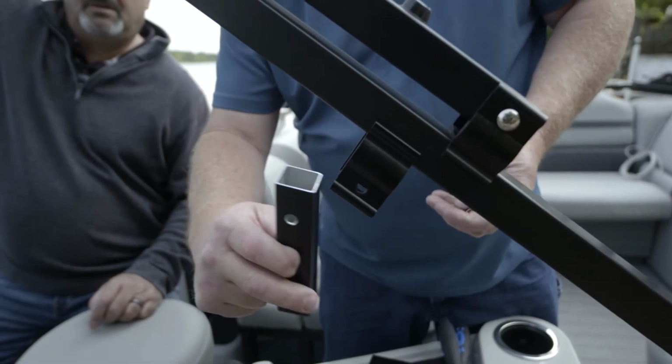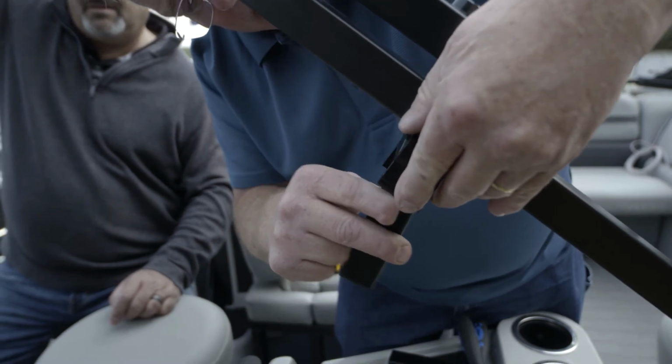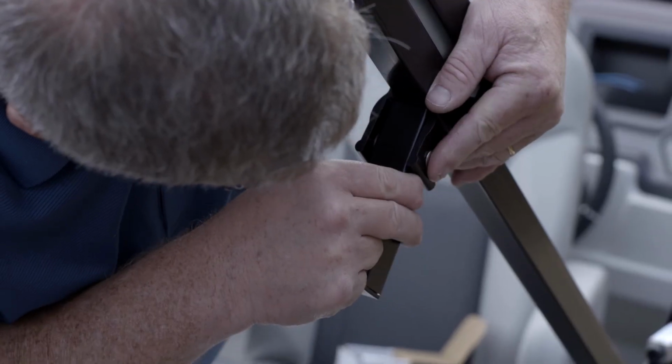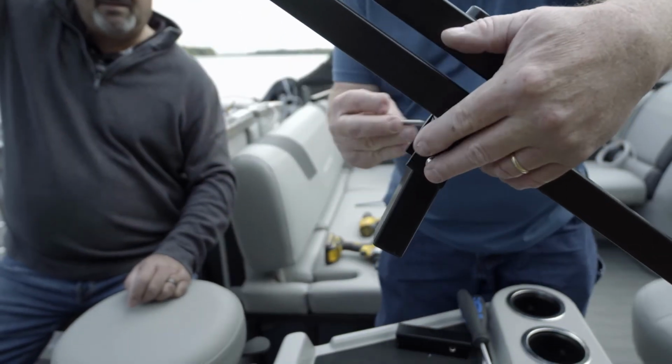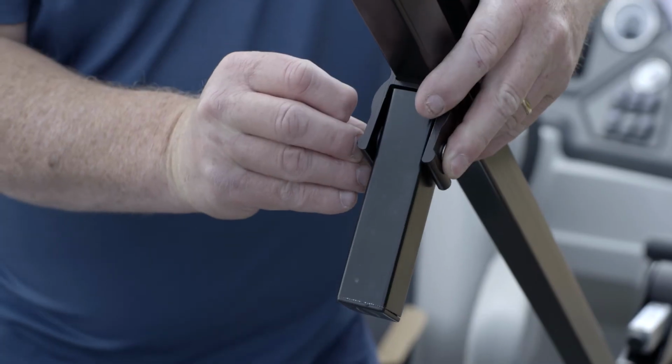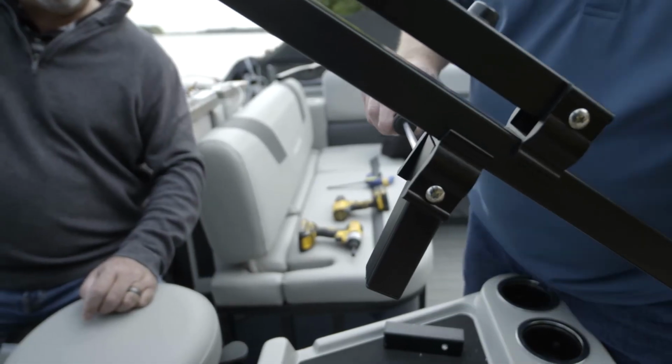First, align the pre-drilled holes in the standoff leg with the holes in the already installed nylon bushings in the H-bracket. And note that the standoff leg has a slight miter that should angle towards the mitered end of the rear strut assembly. Next, align a Phillips screw with a Phillips nut and tighten using 2 Phillips screwdrivers.